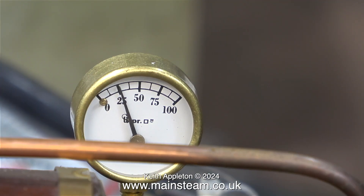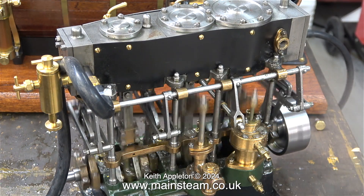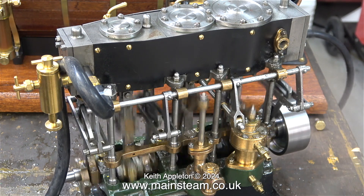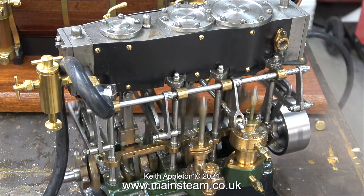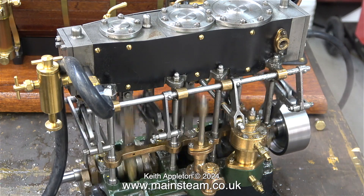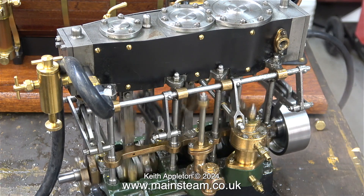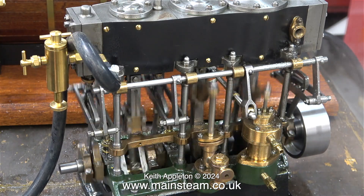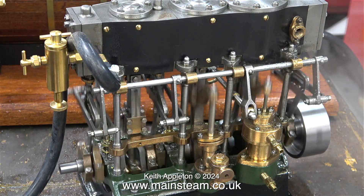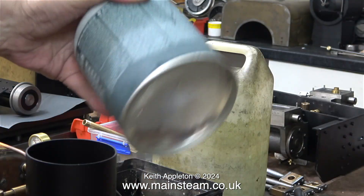The problem is that this boiler does not produce enough steam and the pressure soon drops to 25 pounds per square inch. In the next episode I'm going to start the modification procedure to make this boiler steam properly, and what will probably happen is it will start to howl, which is probably why the air holes on the Venturi have been kept at a reduced size. Mike Abbott used to produce a boiler almost exactly like this one, and he used sliding collars over the primary air inlet holes so you could tune out the howl — quite a good solution, but I never found it that effective. I'll show some potential solutions to the howling problem in future episodes of this series. It's all down to controlling the resonant frequency.